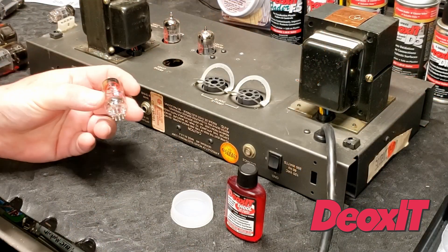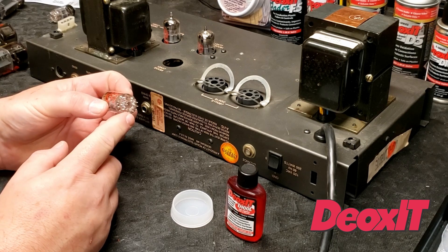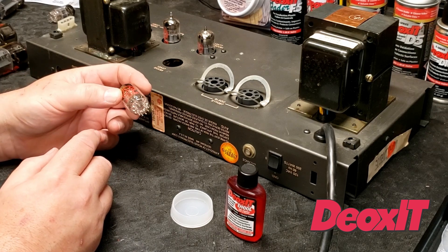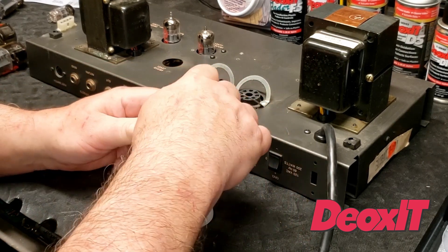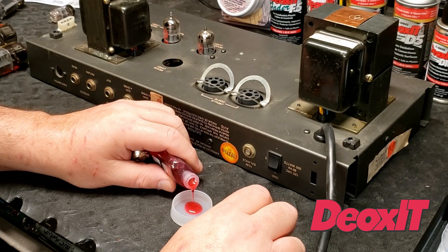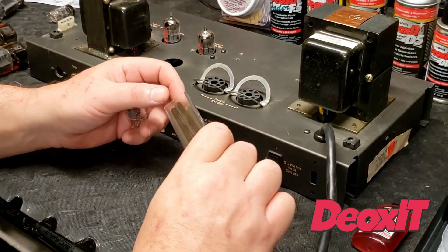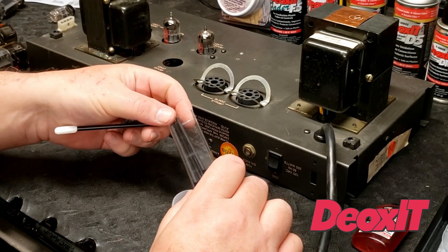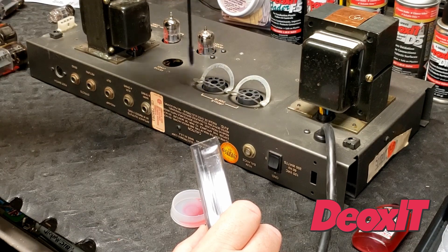So this is a practical example. Tubes come with all different amounts of corrosion. This is a JJ — it's a newer tube. It's not like some of the old Fender tubes from the 60s and 70s where the pins are dark, black, or corroded and look like they have rust on them. But since it's only a modest amount of corrosion, we're not going to fill the container all the way up and soak overnight. We're just going to put a little bit in the dish and then use the cloth to move it around and wipe it off. One thing that comes in the kit that I like is these applicators — a stick with a little sponge — good for brushing the pins of the tube. In a couple of minutes, we're also going to use the one with bristles to clean the tube sockets.